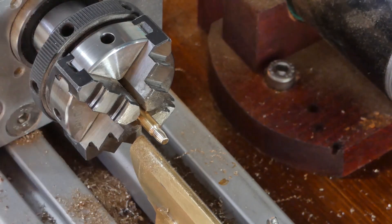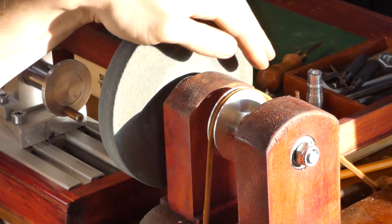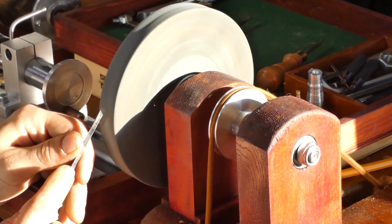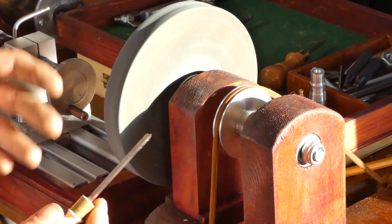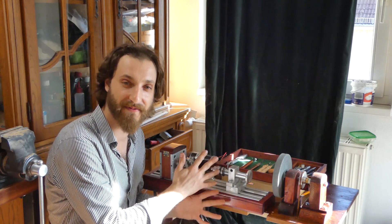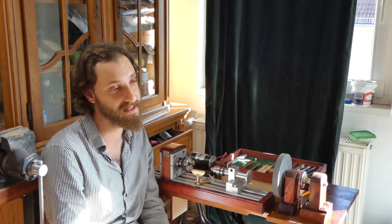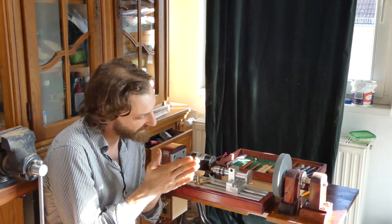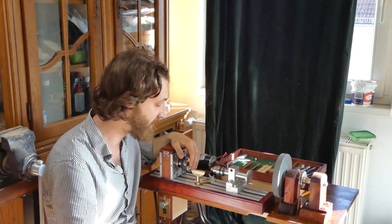That's enough for now; I'll do more projects in the future. I'm really happy where it is at the moment. You're probably wondering what was the point of the sewing machine treadle pedal — well, for now it's a bench grinder, and it seems to do the trick. It actually works fantastically; it's not the fastest and not the most concentric, but it works. I cannot tell you how delighted I am to finally have a lathe. I've now done a few last finishing changes: I put some wooden profiles and fixed the tool rest, which eliminated about 60% of the chatter.